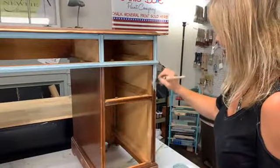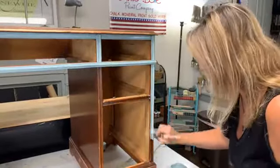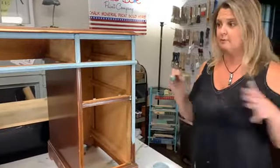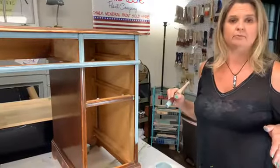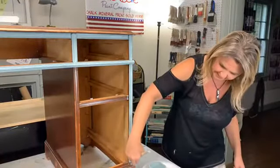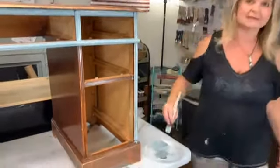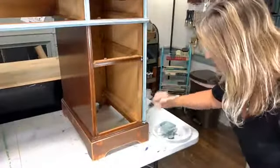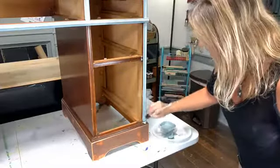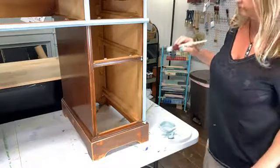All right, so we got Lori Lawrence asking, how do you minimize brush strokes with silk? I've heard some people have trouble with this, and I haven't tried it yet. I'm being totally honest, I have not had a problem with brush strokes with silk. Make sure you prep the right way. Make sure you use a good synthetic brush. Make sure you wait. It's a minimum of 2 hours. If you can wait longer in between, I would. I would say wait a minimum of 4 hours if you can. If you can wait overnight, even better, but if not, that's okay.